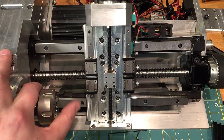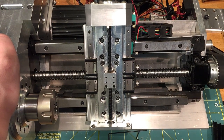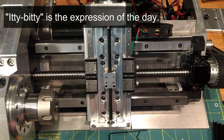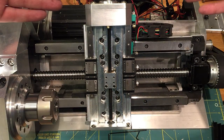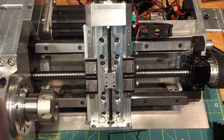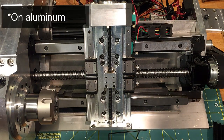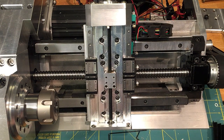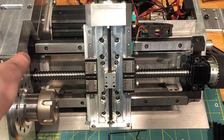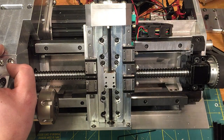The next things I've got to do: I've got to put an encoder on the back of the spindle so I can do some threading. I've got to make an enclosure — I finally made one I was happy with, and then I tripped on it and now there's a huge dent in the middle of it. I've thought of a different concept — I've got itty-bitty sliding doors, but they're so small you just can't do anything in there. So I want sliding doors plus a lid that lifts up if I really want to get in and service something. I want to get the Masso controller put on. Some people have asked about coolant — I've run lathes without coolant and it's usually fine. For a finishing pass you can give it a little squirt of WD-40. I was thinking you can get those really small WD-40 canisters and have it auto-trigger on the finishing pass. I'll look in the post-processor and see if there's any kind of relay I can access.